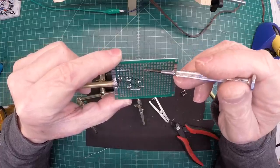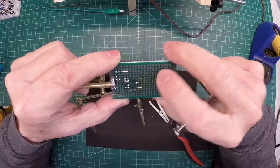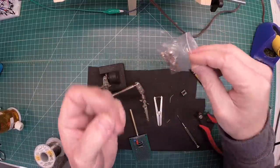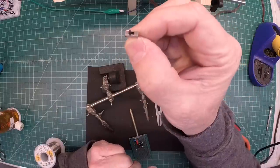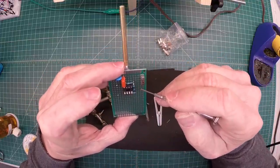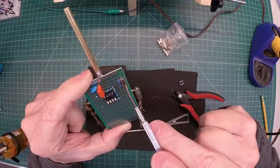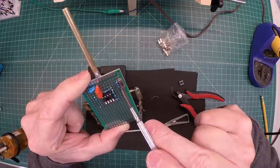This is the ground location coming back up here — this will be my ground rail which will attach back here as well. Being this is a prototype, I'm just using some of the leftover component leads to do the tie-ins. I bought a bag of these little small miniature slide switches — single pole, double throw. This will be the gain switch that will tie back to pin number 2 through a resistor as noted on the schematic. You can see I've got resistor R4 mounted here, which attaches back to the switch used as a gain control. Now we'll mount the little capacitor C4 as well.